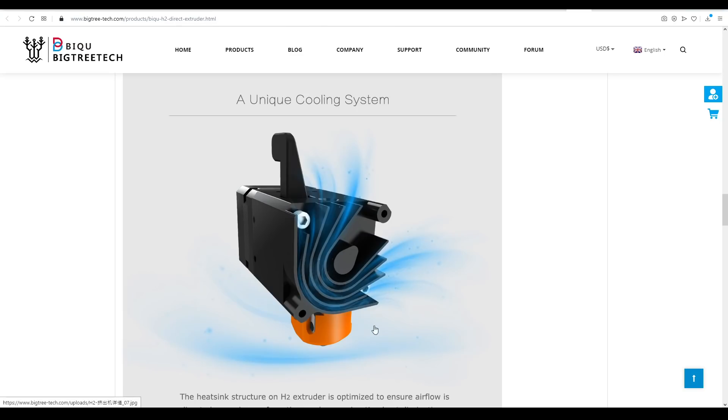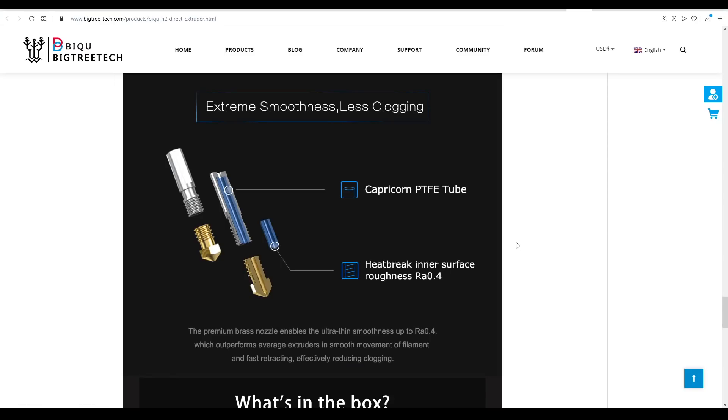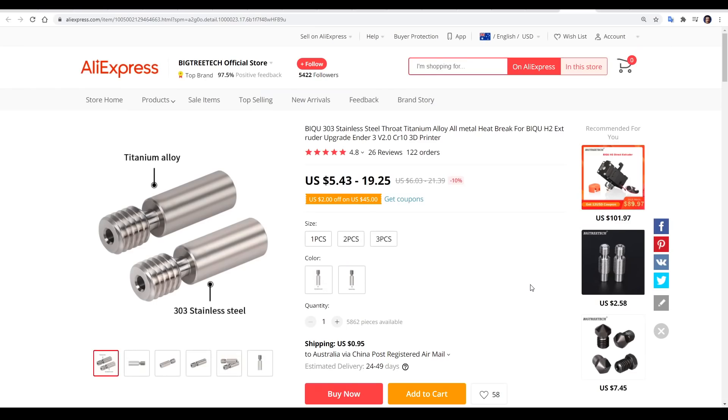Like the Hemera, the heater block goes straight into the body of the unit, relying on a heatsink on the side to keep things cool and also to keep it vertically compact. The H2 comes in two configurations, and the one I'm testing is a lined hot-end — meaning there's some PTFE tube going through the middle of the heatbreak and butting up against the back of the nozzle. Alternatively, if you want to print higher temp filaments, there's a replacement heatbreak available in titanium or stainless steel that will convert this unit to being all metal.